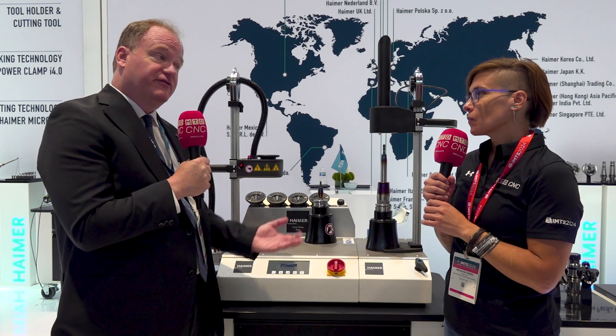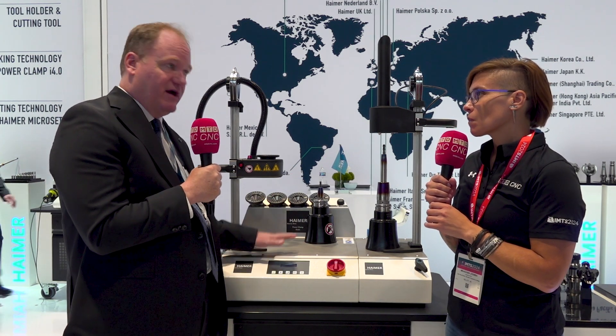So you've got three great systems here and you call it your basic section, but there's really nothing basic about the technology. Let's say I'm a small business owner just starting out — what do I start with first? I'd probably start with the shrink fit system like this one we're standing in front of, because shrink fit provides the most consistent balance repeatability. Putting something like a ball nose end mill in there has very little effect on the balance of the assembly, the runout accuracy is good and very consistent. Also, if the small or mid-sized shop decides to grow toward automation later, they've already got their base level set with shrink fit holders — the easiest tool holder system in the world to integrate into an automation system. So start with the shrink machine and then go from there.